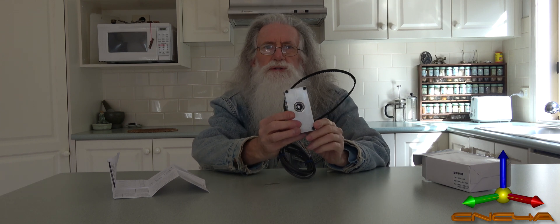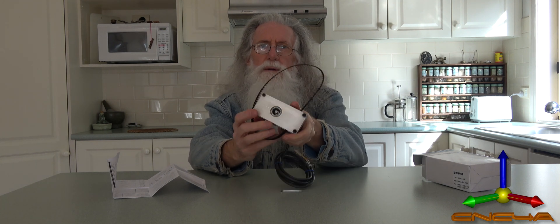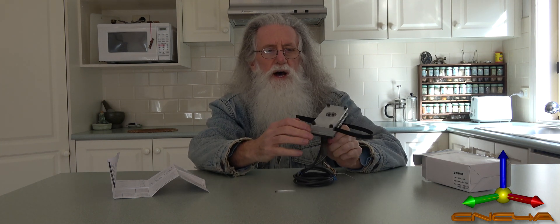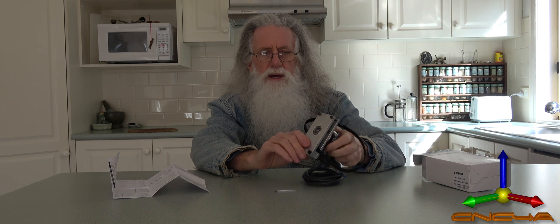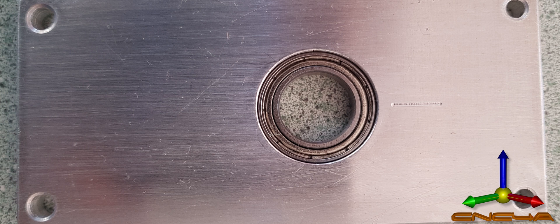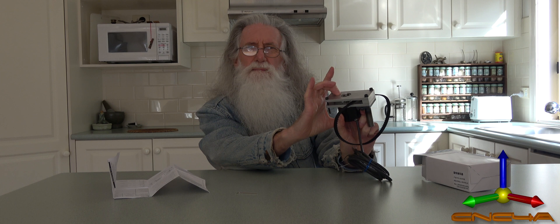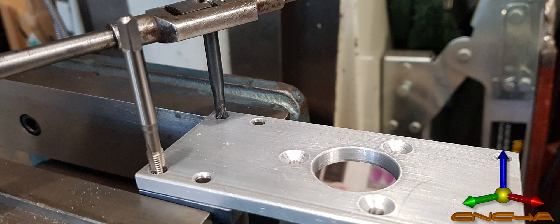You can see the bearing in there. You could have a little tiny bearing that goes straight on the shaft, but it's a D shaft. I looked at the mounting of the XL pulley and all that. So that was the design. As these photos will show, I looked in the raw material box, found a piece of alloy, cut it up to shape, built it up, bored it out for the bearing, and also bored it out for the shaft stub diameter on the encoder. That was just a slight sliding push fit — you'd have to push it in pretty hard and pretty square — then drilled and countersunk to hold it in.